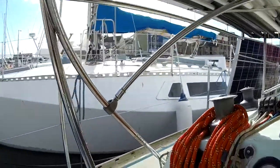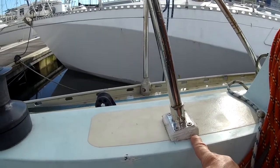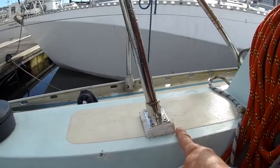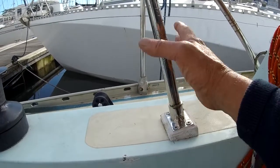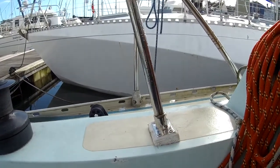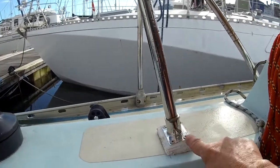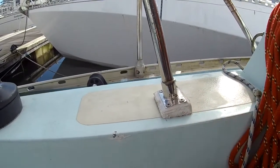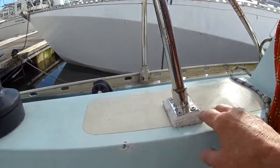So now we've got to look at the pads that it's sitting on. So I had to make a wedge-shaped pad. All I did was I made four sides with no top and no bottom out of thin plywood, this size, and then I popped it on the deck, put this in place, drew a line round so I got the correct angle. When I took the little plywood thing home, I then put a floor in that sat at this angle, and turned it up and filled it full of resin and cast a foot, so that it was exactly flat on the bottom.